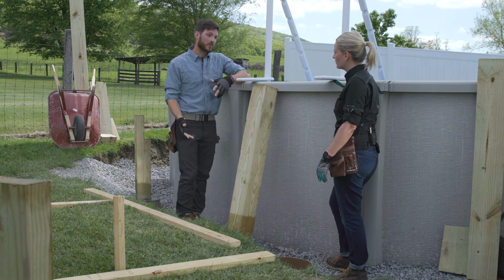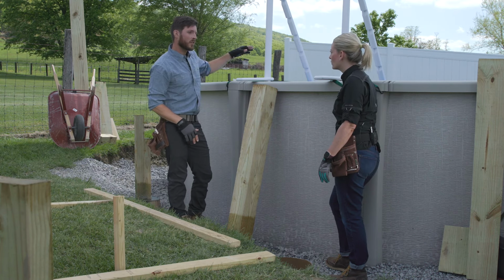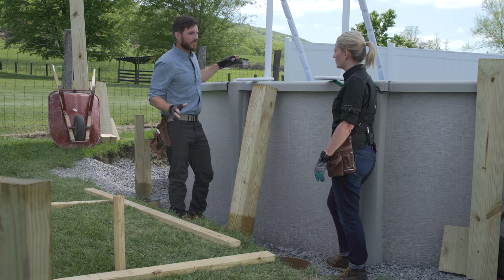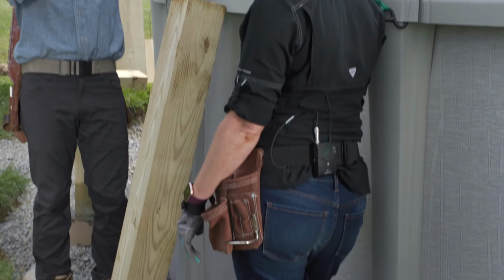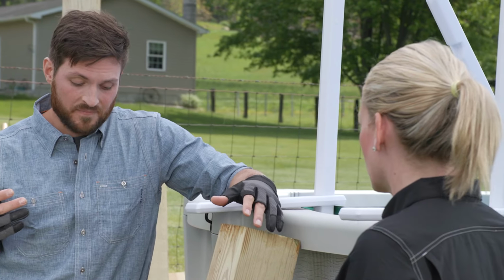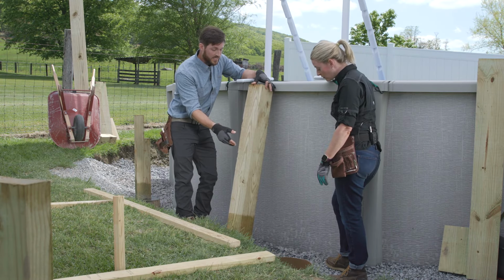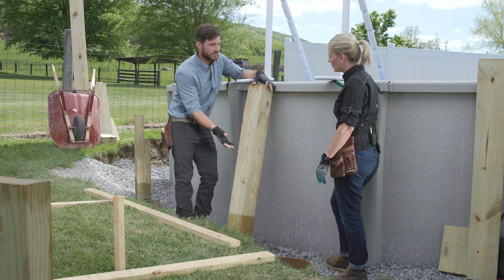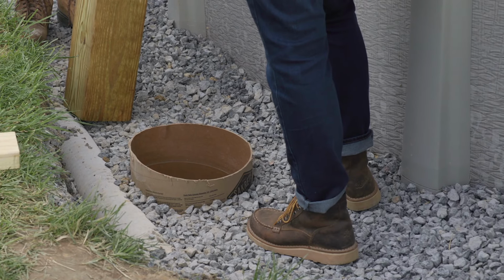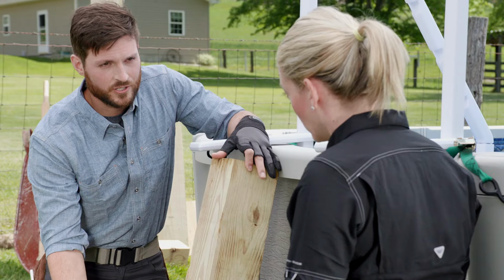It actually caused the homeowner some issues, and that's why she had to install this French drain, which is going all the way around the pool. It's just going to displace any kind of water that wants to sit here, take it away from the home and off of the property. And the thing is, it introduces a new consideration for us, because now when we're digging this footing, we can't just dig it and pour concrete right next to it. Obviously, that's going to cause some issues, right? Could end up even encasing that drain pipe, basically making it unusable.